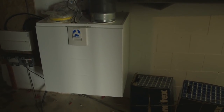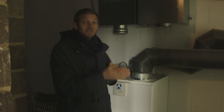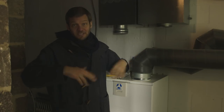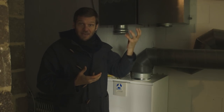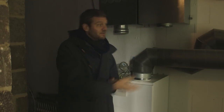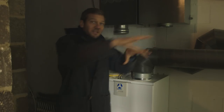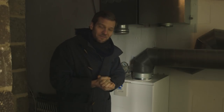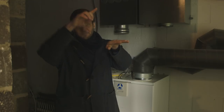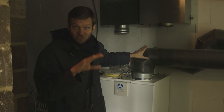This means you lose less energy as you're shipping stale air out of the building. And where it gets really nice is in summer — when it's 25°C outside and you're bringing in air that's too warm, well it's 13°C down there under the ground, and the heat exchanger then cools the incoming air. So it's using the bank of ground as a heat buffer, evening out the air temperature coming into the building during those extreme times.